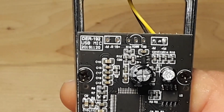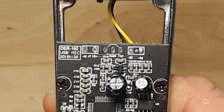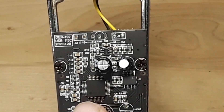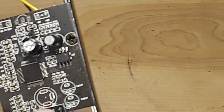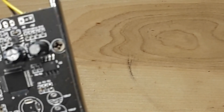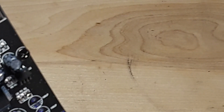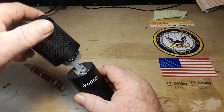Let's take a closer look at the board. I'm reading this at the same time as you. This is a Delta Echo Romeo TAC 192 USB mic. They have obliterated any chance of figuring out what that IC is. This is probably the USB chip because this is a USB type microphone, and that is probably the amplifier. You can tell this is a board for many purposes as we have room for D-minus, D-plus diode, a couple more capacitors. But everything is securely mounted here, and everything else you see is basically just an outer cover.